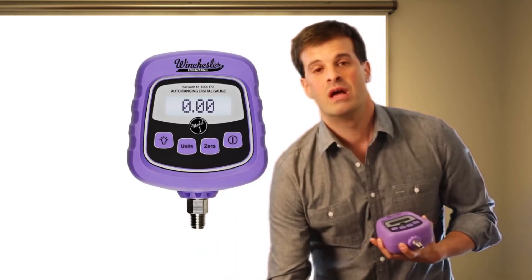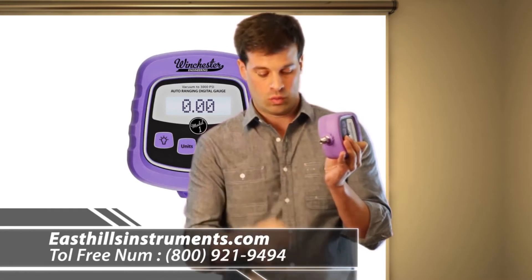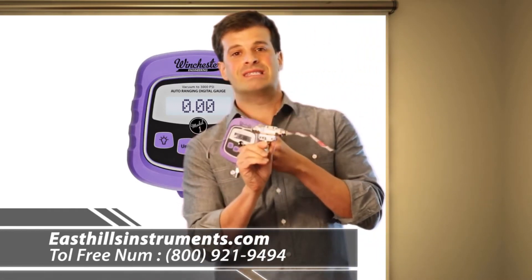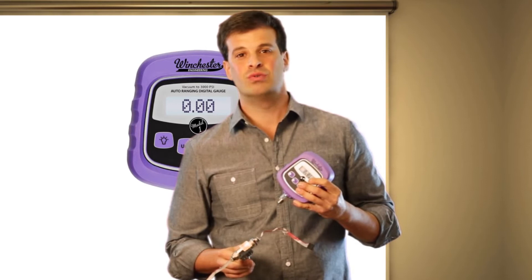The Winchester has a few other unusual features that no other gauge offers, besides the ability to auto-range. You could simply twist it on and off and not have to worry about breaking the cold welds. The reason being is the valve is one solid stainless steel piece — there are no cold welds to break. Therefore, you no longer need to carry a wrench or tool out into the field.